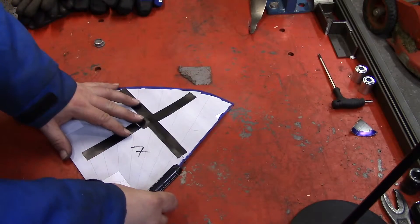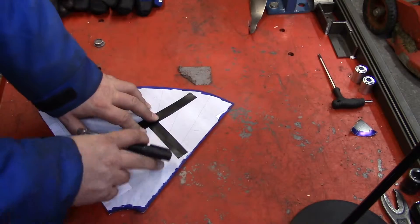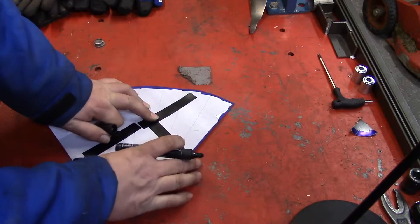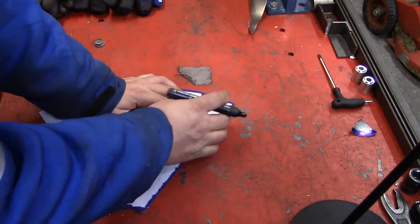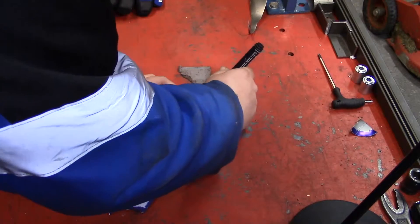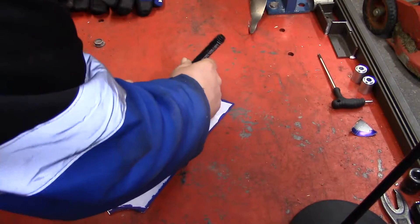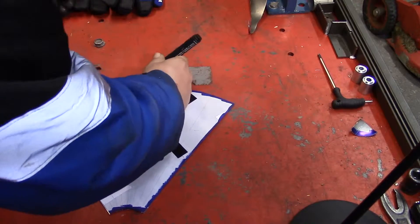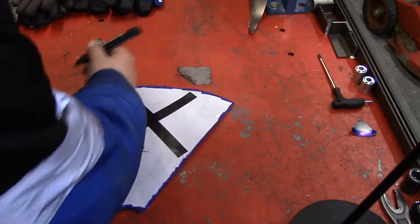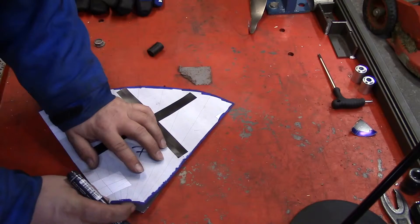It's a good thing when you use the program I have used — the cone layout — that you can actually print out bending lines. Although it's pretty okay to do it without them, it's even better with them. What you can do here is to mark every little line in order to make it a bit easier to aim for where you have to bend it.